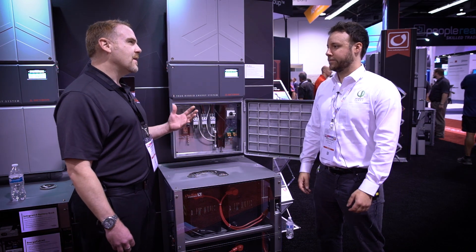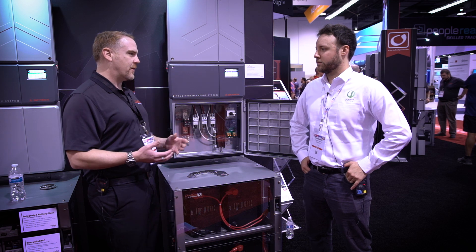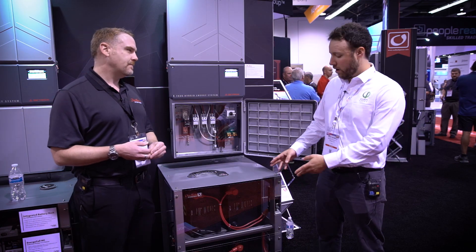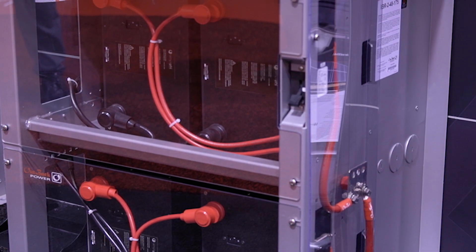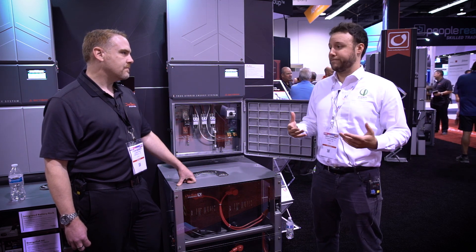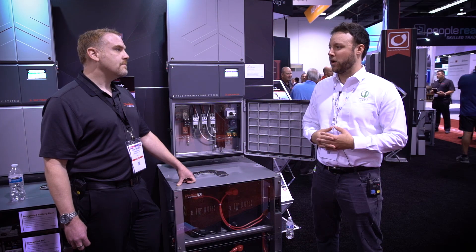Some of our first go-to-market plans with Skybox are in Hawaii, New York, New Jersey, and California. Can you tell us how SimpliFi helps people doing power trimming, reducing bills, demand response, and things like that? All SimpliFi batteries come with a 10-year, 10,000-cycle warranty at 80% depth of discharge. When you're doing time-of-use or peak load shaving, you're still within that warranty. These batteries have a high power rating and can pull at what we'd call a C/2 rate, which allows for some serious demand response applications.